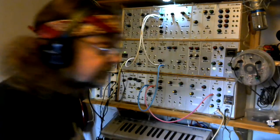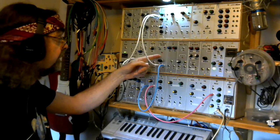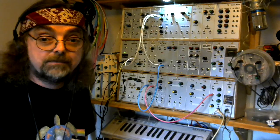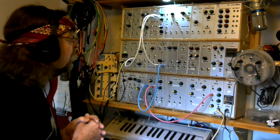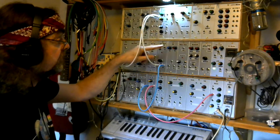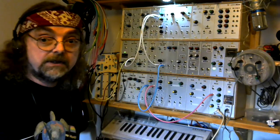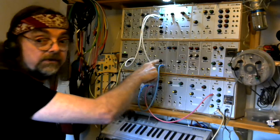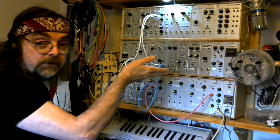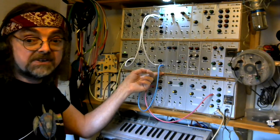Let's have a look at the panel. This is the clock divider panel — pretty much what you've seen in previous videos. I can switch the AND gate in or out. I've got a reset button which resets the counter on the 4017, and then I've got the rotary switch which selects at which count the 4017 will reset. Then there's an input and an output. Pretty simple.